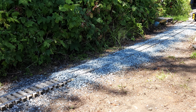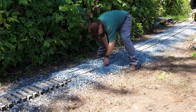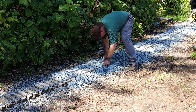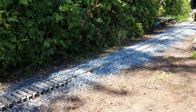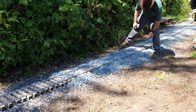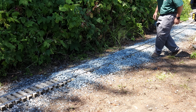So I'm looking at the side profile of this, and I see I need to bring this up right here. If you're wondering what I'm doing here, I am eyeballing the side profile of the track and looking for dips, and then pulling them up out of the ballast. Is that enough? Not quite. I've got to go back some more. Now that I'm watching the footage, I realize this is also a tedious back-and-forth process, but trust me, it works.